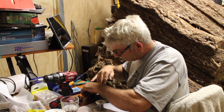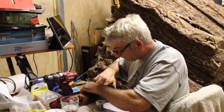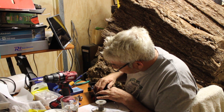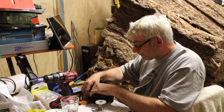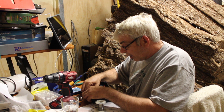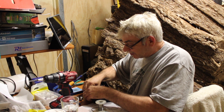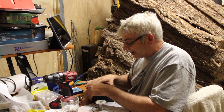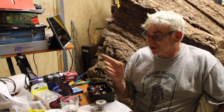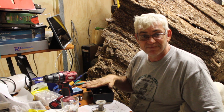The first one didn't quite work because there's only very, very low voltage running out through the phone set, so it's not easy getting that to work. Andrew even had to throw in another power supply — he needed a power supply to supply 12 volts direct rather than coming off the intercom when it's switched on.